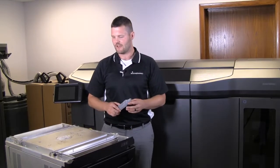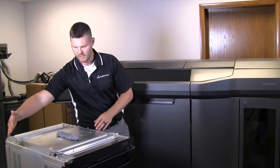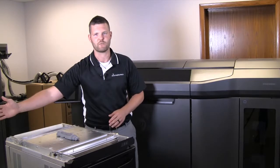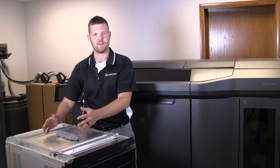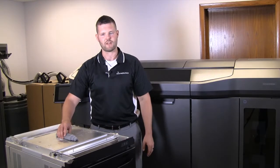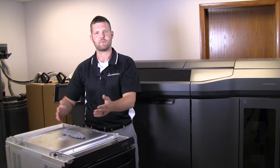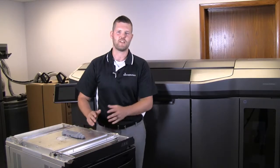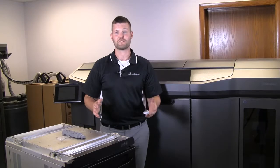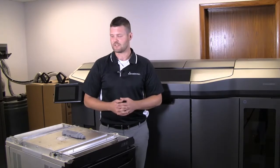The other important feature of the MJF process is that it's layer-based. What that means is that when a part is printing in the build plate, a print head is coming over and printing whatever is in its way, regardless of what geometry is there. If you print one of these, it would take the same amount of time as if you printed five of these in a row, based on layers — similar to how your 2D printer works. If you type more words on your Microsoft Word document, the paper doesn't come out of the printer slower. It's just printing whatever you tell it to print.